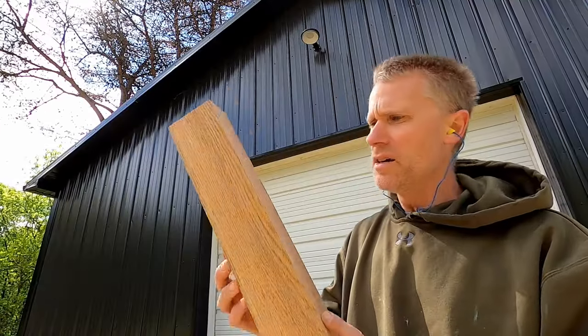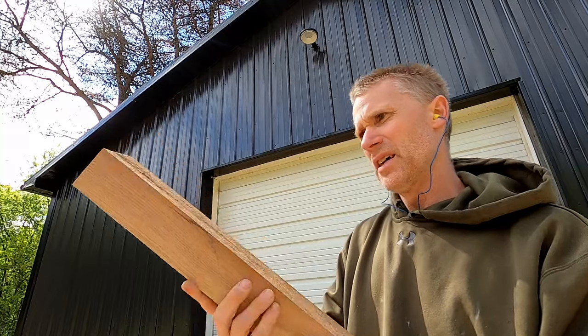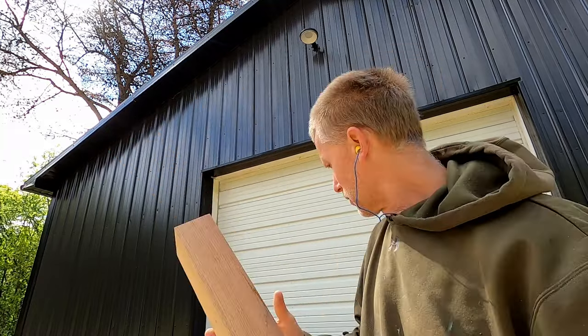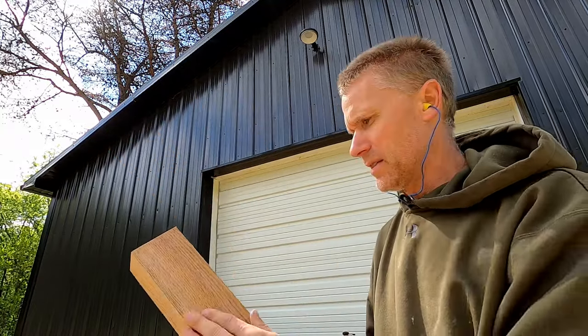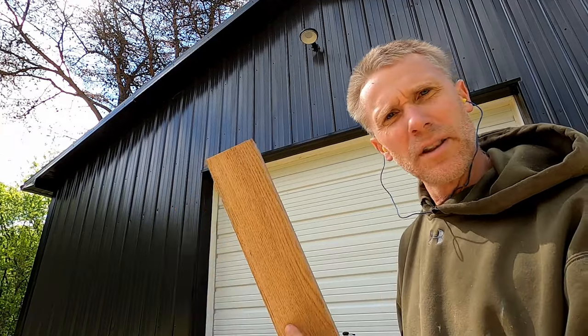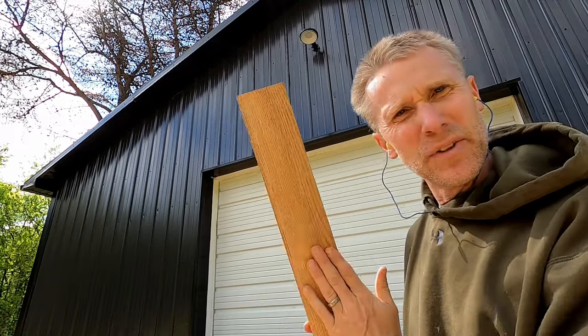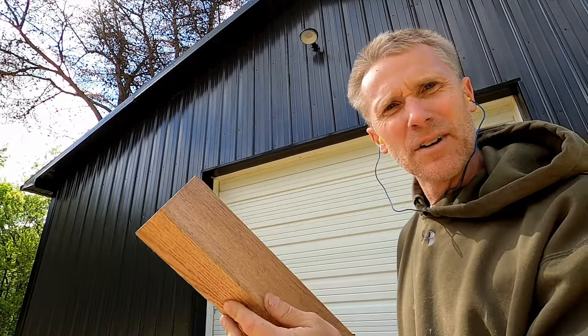Well, the beauty is starting to come out a little bit. Starting to see that there's some potential for some beauties. That was what it did look like. So anyway, I'm going to run it through my planer, get the same thickness for all my boards. Again, we're still focusing on the legs, table legs. Once we do that, it'll be time to start jointing them together.